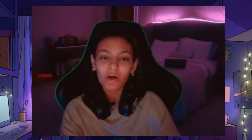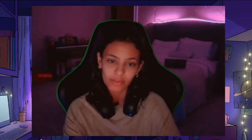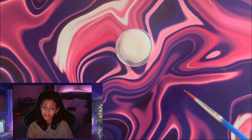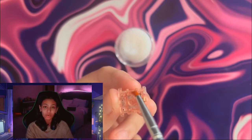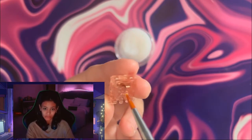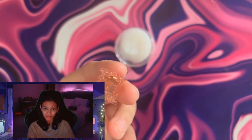As for the bottom housing, take your paintbrush and apply a very small amount of lube where the stem rails rub on the sides. Switches have a gold plate, dubbed a leaf, that lies near the bottom housing. The place you should be lubing is on either side of the leaf. Make sure no lube touches the leaf itself, because that's actually what registers the switch. Again, if you see white residue, you're doing it wrong.